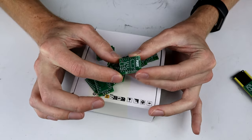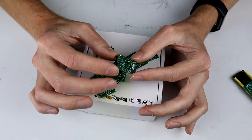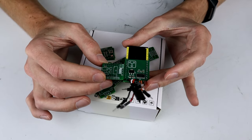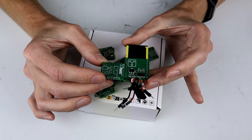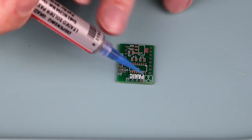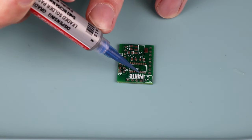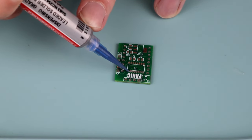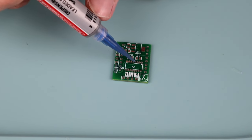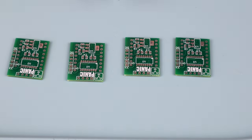It's honestly awesome that you can just order PCBs nowadays and get something like this, which helps miniaturize all of that mess — we don't need a separate ESC board and H-Bridge board, it's all connected together on one thing. The process of getting these boards together is going to be fairly similar to the last version. We're going to be SMDing our components onto here, which starts with some solder paste — just applying solder paste to each of the pads. You can run the solder paste kind of between them; it doesn't really matter too much because when it melts it will wick to where it needs to be and hold all the components down.